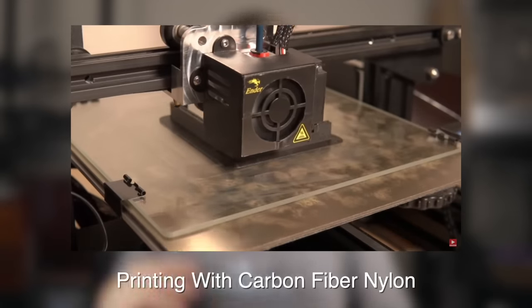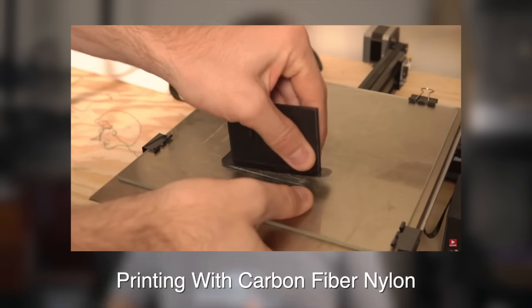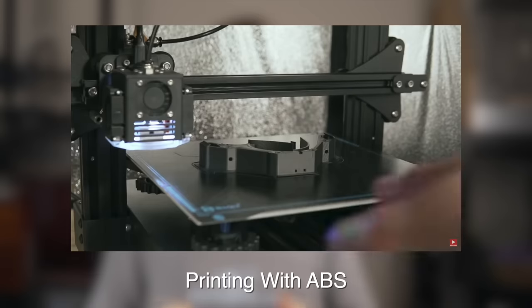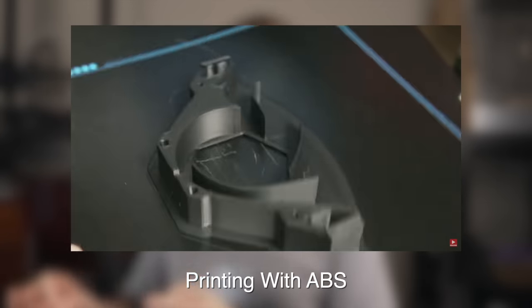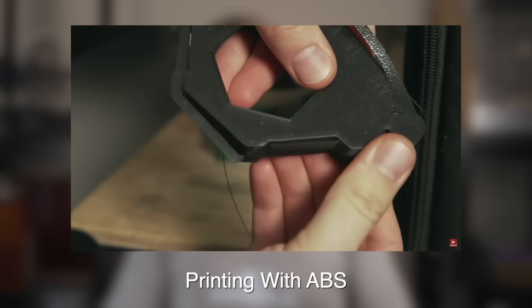The primary use I've had for brims over the years is really when I'm printing with higher temp materials or more advanced materials that have a higher tendency to warp, typically due to their larger shrinkage ratio. I mentioned that in my recent video on printing with ABS — I used a brim just to ensure I wasn't going to have any warping. With ABS, it's not necessarily fully needed, but I always have the mindset that if I can just have a brim on this part — which is typically easy to remove on ABS — then it's worth it versus possibly losing a three-hour part. Brims are definitely not something I use all the time, and unlike skirts that are separate from your part, these will actually need to be removed upon completion of your print. Depending on the material, sometimes brims can be fairly easy to remove where you can just bend the brim and it'll peel right off, while other materials like polypropylene actually required a deburring tool to remove the brim from the model.